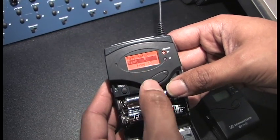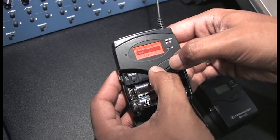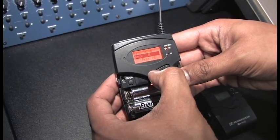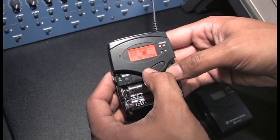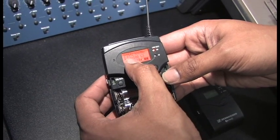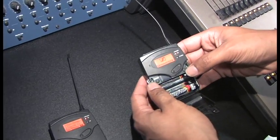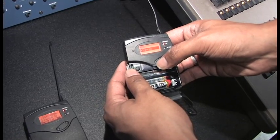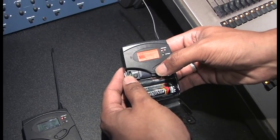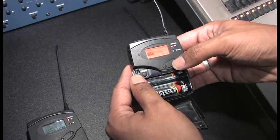Once the scan is done, it should give us a default setting. Bank 5 has 12 frequencies free — there are lots of banks to select from, so let's just go with the default one. Bank 5 has 12 frequencies, so I'm going to select that one. The first frequency is fine. We're going to use 542.900. So I can turn my transmitter back on, and then in the menu I'm going to go down to advanced tune and make sure that it's set to that same frequency — 542.900.